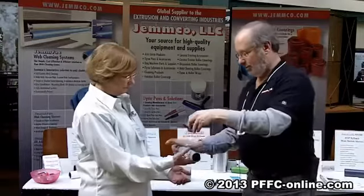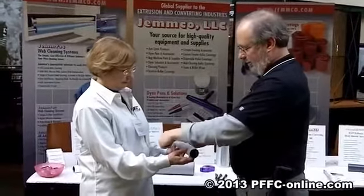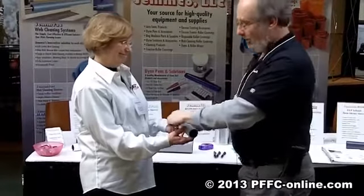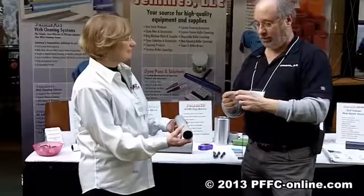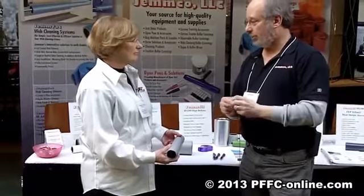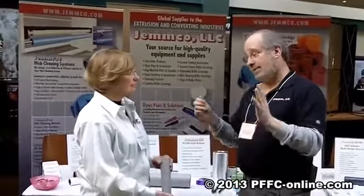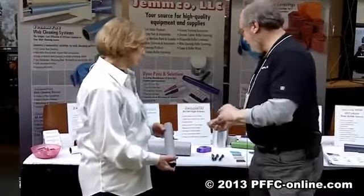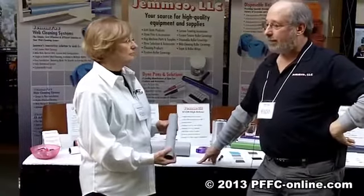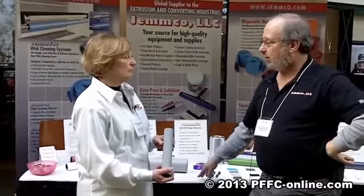Can I help? Sure. I'll let you hold that. As you can see, it doesn't stick. Right? And we've tried it with a number of different adhesives, and it works extremely well. It has operating temperatures up to 400 degrees Fahrenheit. So it can go in a wide variety of applications, including some ovens. It's easy to clean, just using isopropyl alcohol and water. And it's an economical alternative to a lot of the hard coats that are out there.